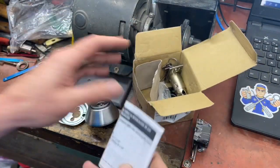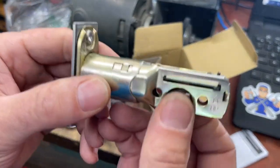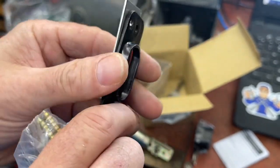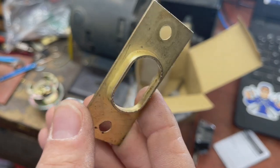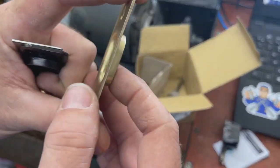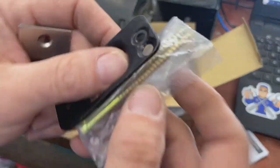Most of the time you're gonna be putting these in a wood door with a metal frame or whatever, but you probably won't be using some of this stuff — very rarely do you. This is definitely an LSDA-style latch for sure. So Dexter — back in the day when Dexter was just residential — they came with this lipped strike plate and you had to cut an oval-style hole instead of just a round hole. That's how Dexter used to send all their residential deadbolts, and now that's a security strike version with three-inch screws and a cover plate.